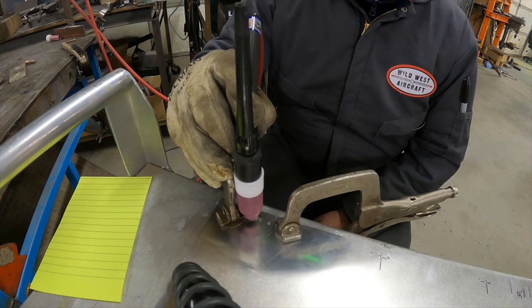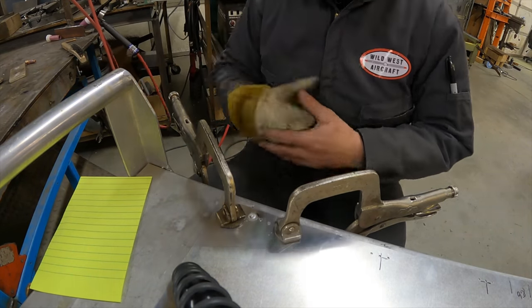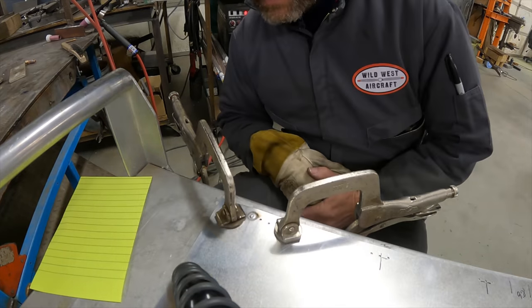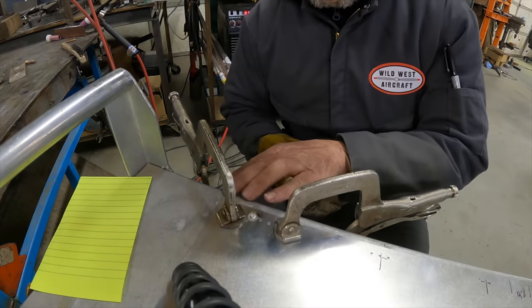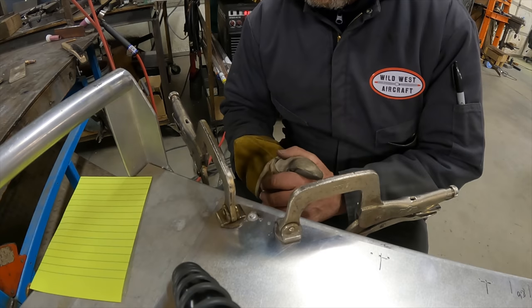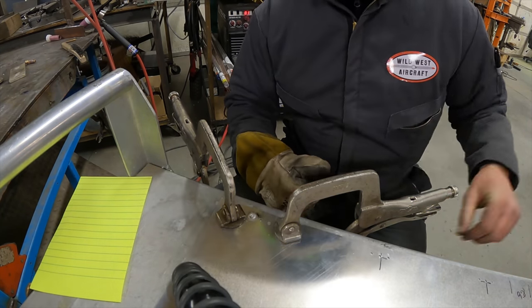Keep that cooling. We welded it perfectly, but because I had to do it twice, it warped a little bit on the bottom side. I'm going to put it in the brake and try to straighten it out a little bit, and then maybe do some shrinking with a shrinker that I'll bring in tomorrow. Let's go for the next hole.